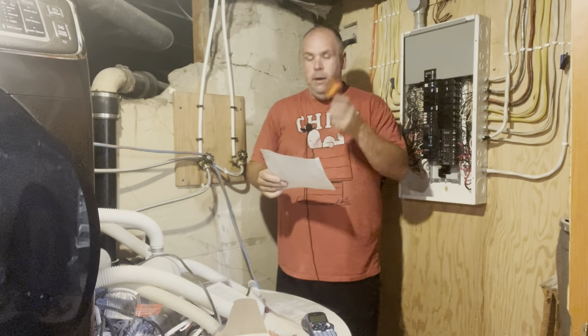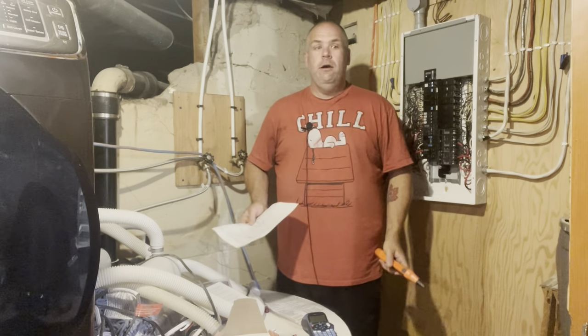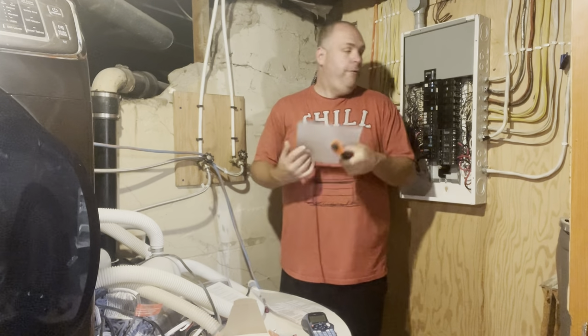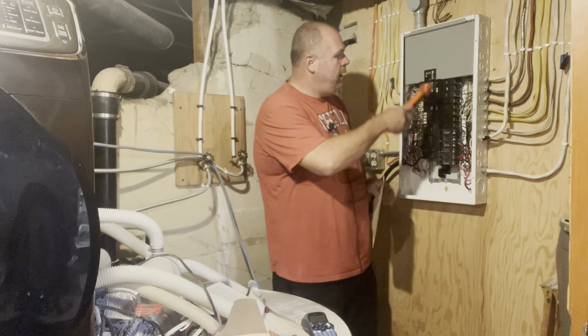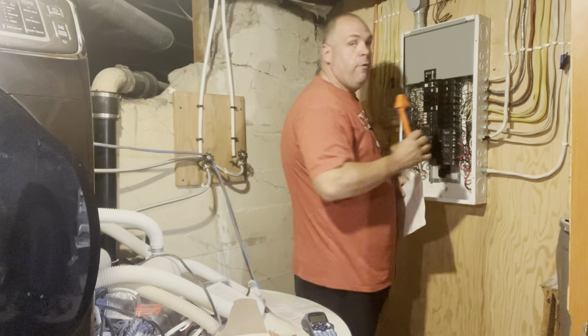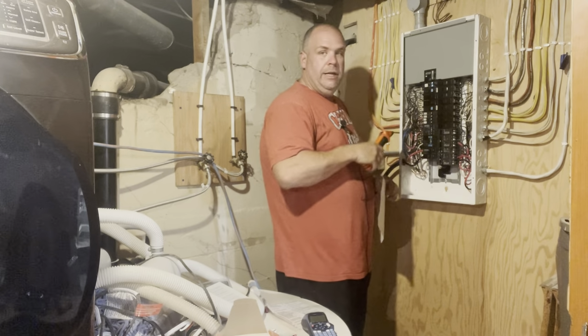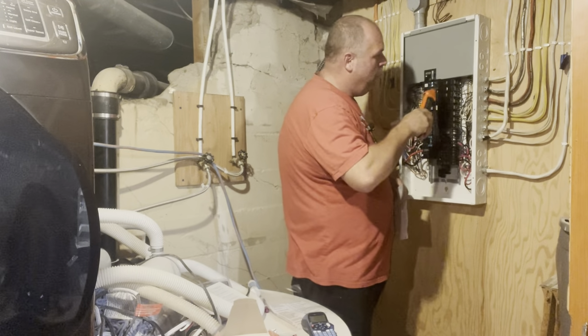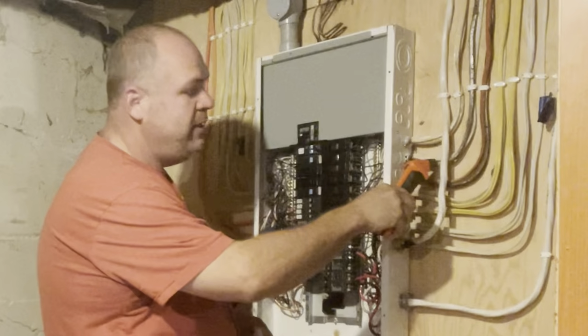Now, when it was all said and done, I still had a single breaker. It was number 6. I could not figure out where it went. So I thought, well, what are we going to do? That's why the cover came off. So one thing you can do is count down. You got number 6. Look there. Of course, turn your power off, or at least to that breaker. Don't touch anything. Just use a flashlight to trace the wire back. And then you'll find this is the one where it comes out.